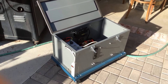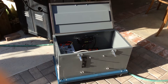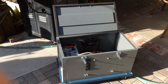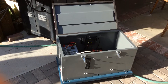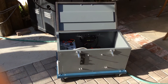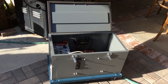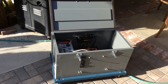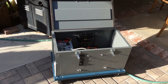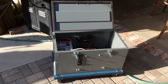There's all kinds of ways to do things. I love playing with solar, so this is the next one. I see a bunch of people on YouTube build these little cheesy ones and you're just not going to get a lot out of them - they don't have that many amp hours. Yeah, you can run a drill and this and that, but you're not going to run a TV all day long because you have to have a lot of power to do that. But for backup, for lighting, for tailgating, stuff like that, these are great. I went with 12 volt just because there's so many multiple ways of charging. It's not a big system, so it doesn't need to be 24-48 volt on a small system scale.